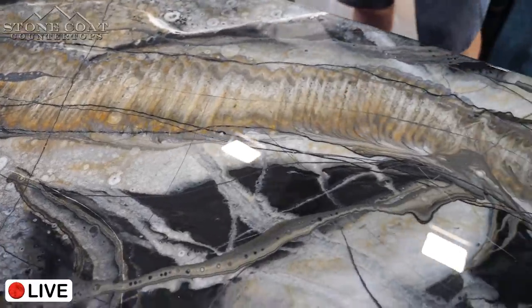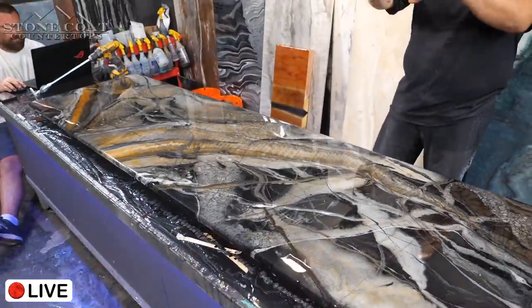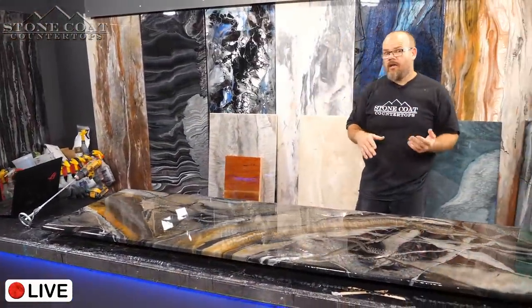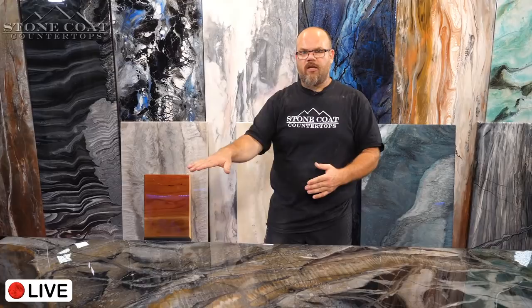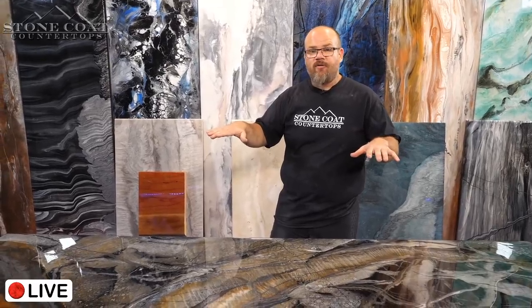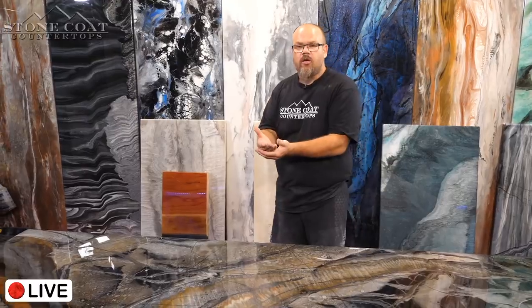You put a little kid on the overhang of laminate where he eats his cereal, where there's an overhang that's unsupported, and that overhang will have some flex to it. The resin would be fine in the beginning, but as it cures harder, it's going to fracture. So we've formulated it to have memory, meaning you set heavy objects on it, you might get an indentation, and you lift that heavy object up, and in normal temperature, it's going to have memory and come right back flat. If you want to expedite that, apply a little heat from a blow dryer, and you'll watch it grow right back.